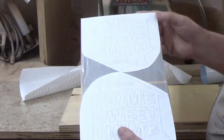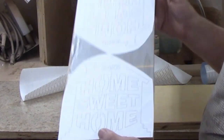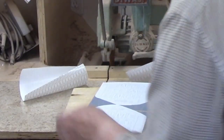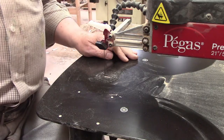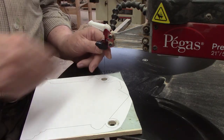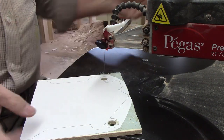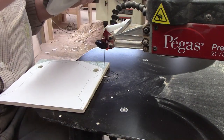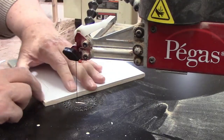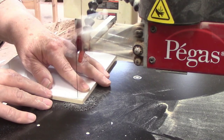Now that the patterns are attached, I'm going to cut this board in half to make the wood easier to manage at the scroll saw. I'll take the pieces to the drill press to drill the pilot holes for the inside cuts. I'll take the other piece of poplar, plane it down to one-quarter inch thick, then apply the patterns for the backer. I thought I'd start with the easy part — the quarter-inch backer. There was already a number three Pegas modified geometry blade in the scroll saw from my last project, which is the blade I would have chosen anyway. I make my blade choices by taking into account the thickness and hardness of the wood as well as the complexity of the pattern. I'll leave a link to my video on blade choice sizes on the screen and in the description.